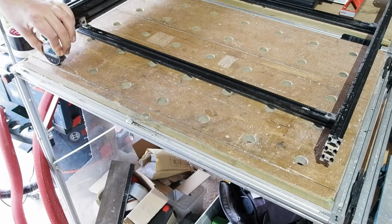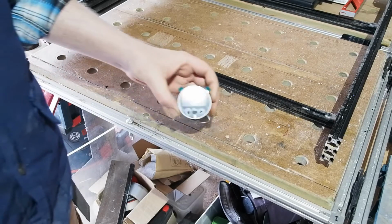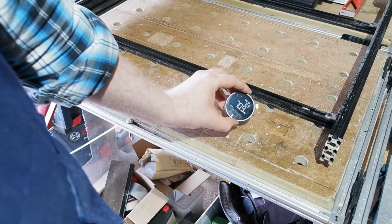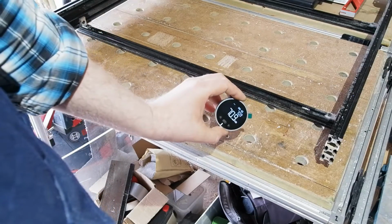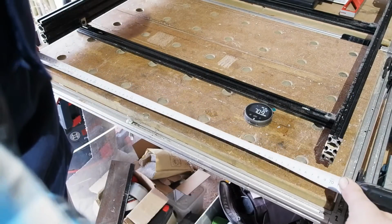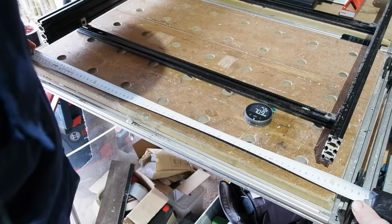Here in open-ended mode, you line the centre line up to the edge and roll the measure to the other edge, or wherever you want to stop. Here I got a reading of 709mm, which is pretty close to the 710 I know this benchtop to be. This was, however, as close as I got to 710 from several attempts. I was getting a slightly different reading every time. Next, I'll look at the enclosed mode.